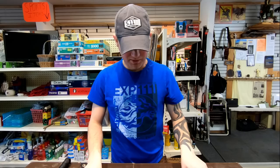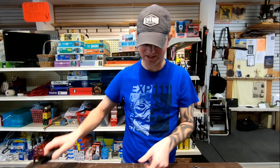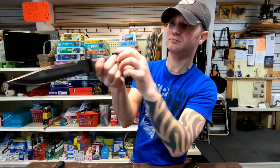It can double up as a lot of different things. They do attach pretty good. Another thing you need to be aware of is the Smith & Wesson is just billet, same with this part. The Ontario parts are forged. With forging, you've got your piece of metal and a die smashes it, so the grain on the metal will be pushed into where the die is — the grain flows around like that. That's all great.